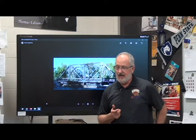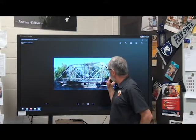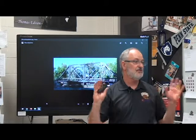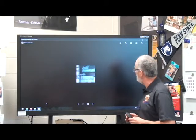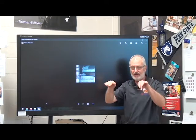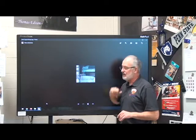I'm showing you that bridge because we are going to talk about something called pinned supports and roller supports. From some of the things we've looked at before, we know that bridge is going to experience some movement. Even though we're in statics where we assume nothing moves, there are things that are going to make that bridge move, so it has to be able to give somewhat. Here are some pictures of some roller supports. That one is very hard to see, but it's shot up towards a bridge — you can drive down the highway and look for these things.